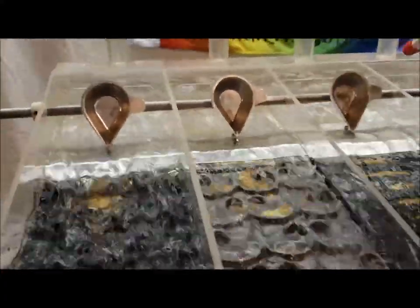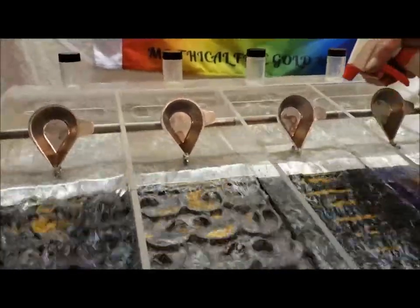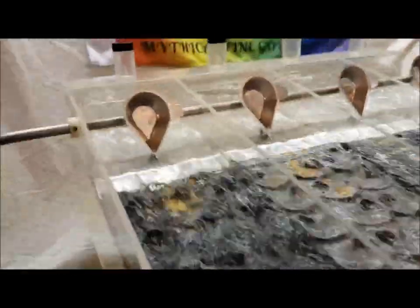That gold that's up in the top of there. So it looks like we got all the gold out, and it looks like we got all the gold off the top of the ramps. And now we're looking at the gold as it goes through the system. One of the things I wanted to do is see how the gold hangs on the top of the mats. I'm going to take this little brush to show you how little current. This test is really easy: we're just going to brush across the top there, just to get that gold that is right at the top off.